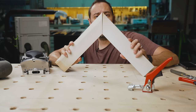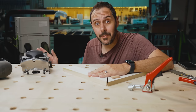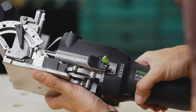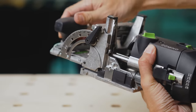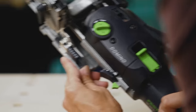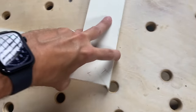Let's try this miter joint, common for things like picture frames, using the 8x40 Domino. I need to change the bit — this currently has the 5mm installed, I've already unplugged it. I change the cutter head. Since we're doing an 8x40, I want to go 20mm in. I set the fence to 90 degrees. The material is 19mm, so I'll round up to 20 and use the 20mm depth stop. I have the tight setting on the far end because I can reference that, and then I use my eye for the middle.